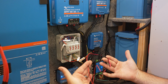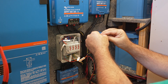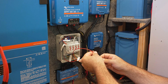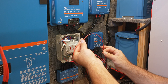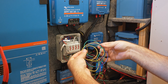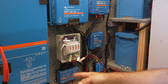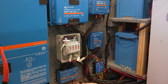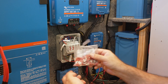Because I pre-ran them, I know which wire does what. The thicker gauge wires connect the system positive and system negative. The other wires connect back to the BM Pro for generator start and stop — red for start, black for stop. For the Cerbo wires, I have three different color wires for NC, NO, and common, which connect to the Cerbo GX using the little relay connector that comes with it. I use 18mm length ferrule pins, which work nicely with this connector.